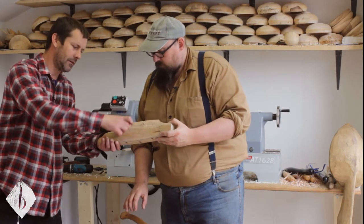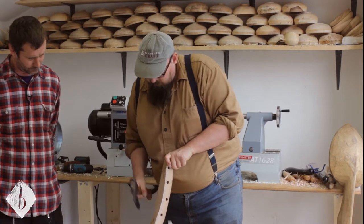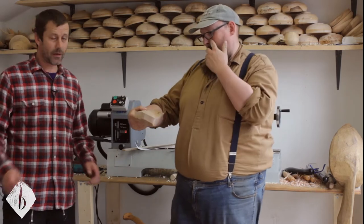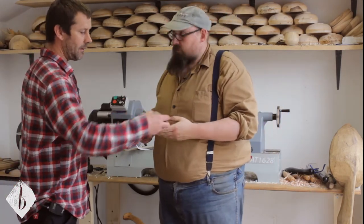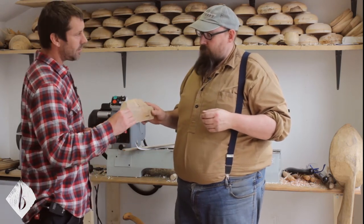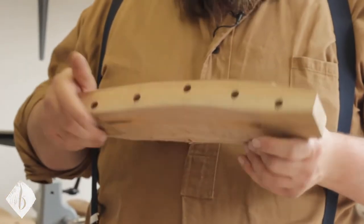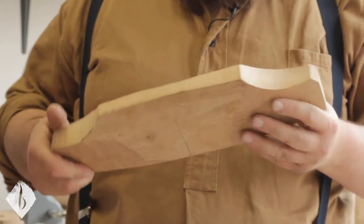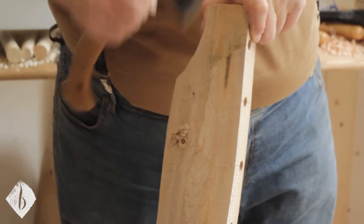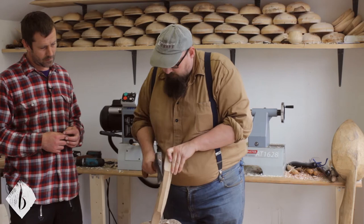Did we not put a nice facet here? Yes. Another thing to keep an eye on as you go — this is where the arm goes in, so you're going to still need plenty of wood there for strength. I think we're probably getting there. Just do a bit of to and fro on this knotty bit to get slightly more material off and leave it a little bit neater. That's the basic rough shaping of the crest.